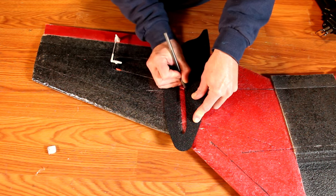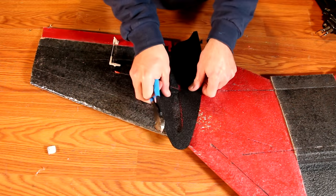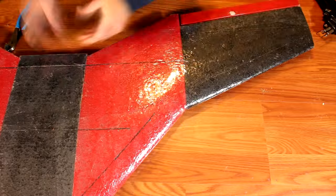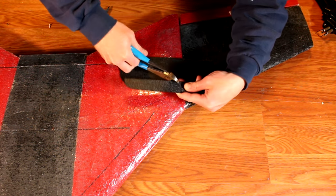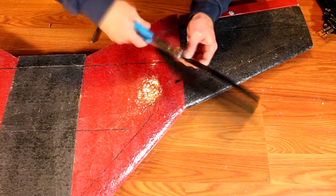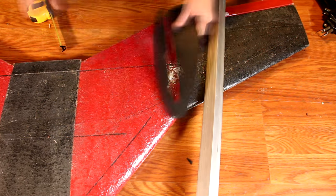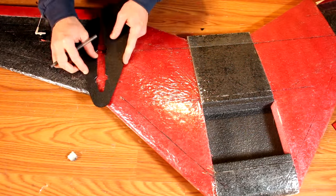The mid-wing stabilizers are installed by embedding them into the wing. Lay the stabilizer approximately one half inch back from the seam of where the mid-wing meets the tip and mark out where your spars and servo wire come through. Then take a pair of scissors or diagonals and cut a V-notch to cut out these areas so they might fit through the stabilizer when installed. Be sure to notch out all of the areas — it's okay to make the notches bigger than they need to be as there will be plenty of ABS embedded in the wing to make it strong. Repeat this for both sides as well as the top and bottom of the stabilizer section.